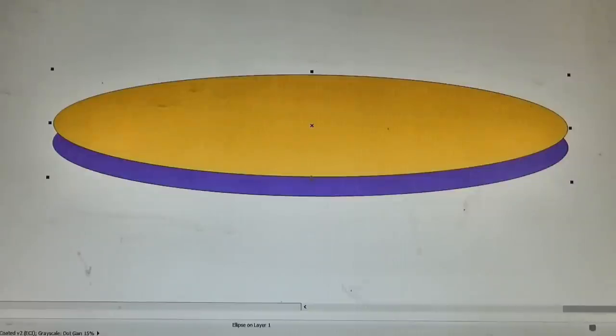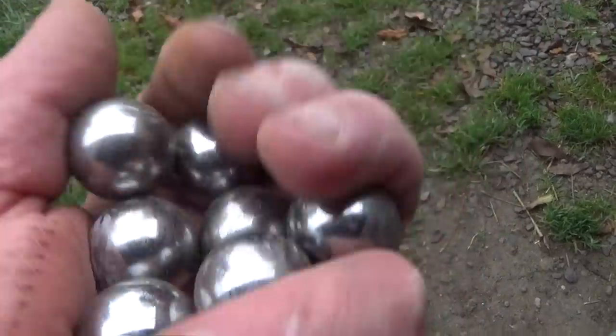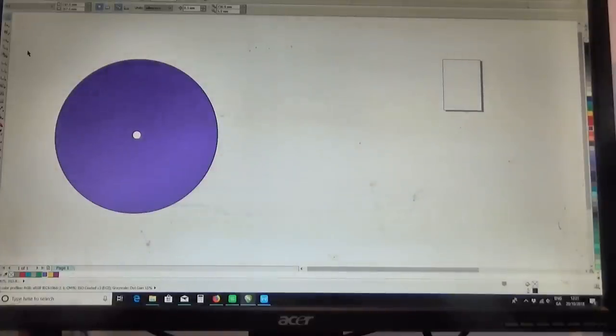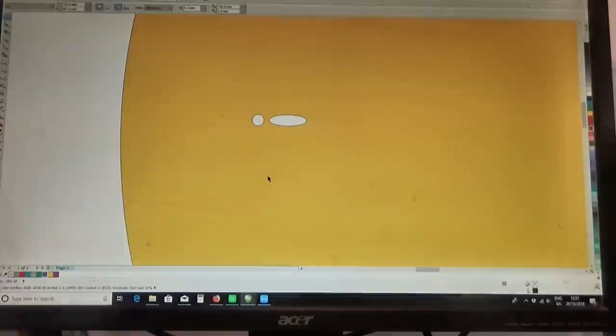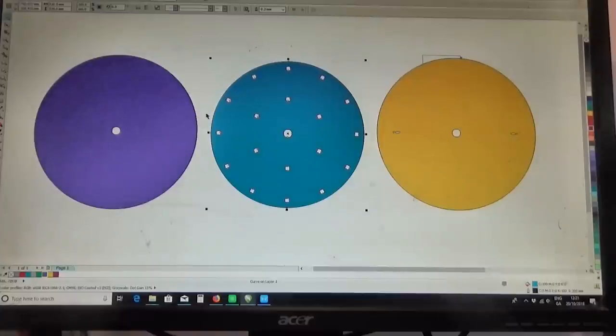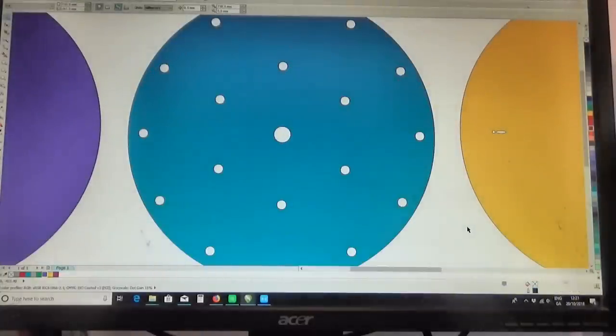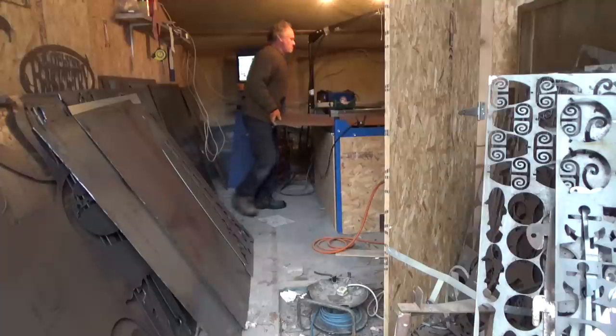Anyway, this is what I came up with. I'm going to use a disc of steel at the bottom of the hole and one near the top, and in between I'm going to use 22mm ball bearings. I'm hoping that the top disc will spin freely around on the bearings, but I have no idea whether this will work, especially with a trolley on top and a heavy load on top of that. I drew out the discs on the computer and added small holes in the top one to accommodate lifting hooks. I also drew up a middle disc that sits between the top and bottom ones to keep the bearings in place. Here's hoping it works because these are expensive lumps of steel.